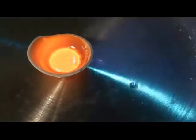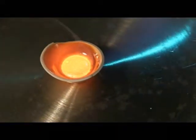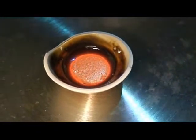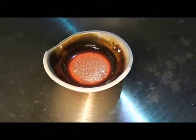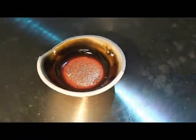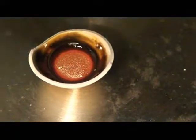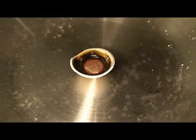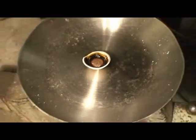There it's a molten button now. I'm just going to take the heat off and you'll see it gloss over — there it goes. The crucible broke earlier because we heated it up too fast and not evenly, so the top broke off. Those crucibles are really used for a furnace instead of a torch.